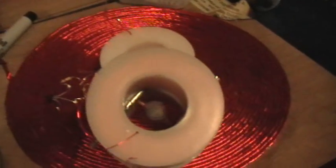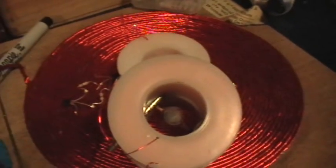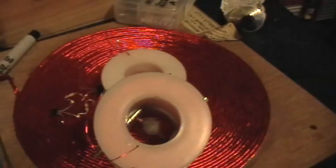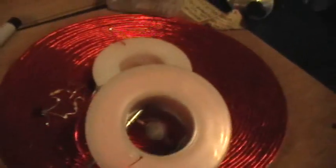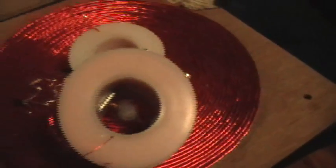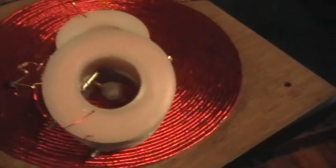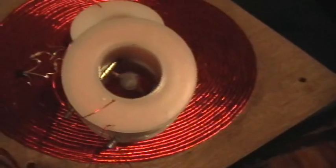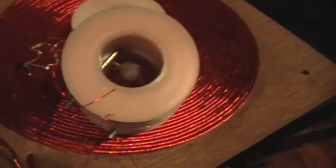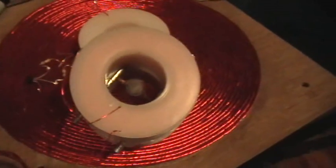150 Hz. That's 180 Hz right there, and as you can see it's spinning. Let me turn on the strobe scope. So 180 Hz — 180 times 60, I'm doing this on my calculator — 180 Hz should be 10,800 rpm.